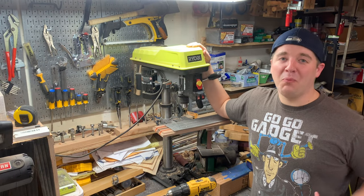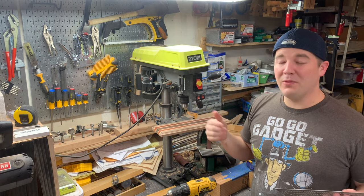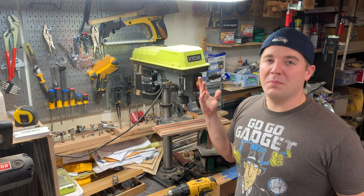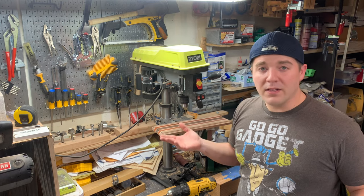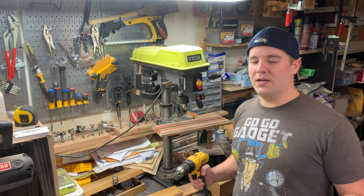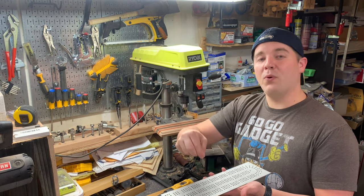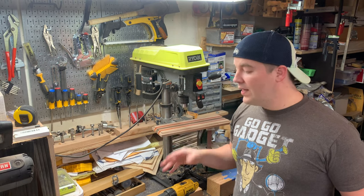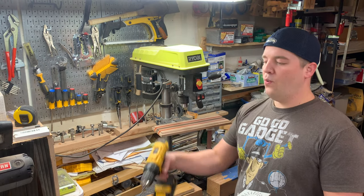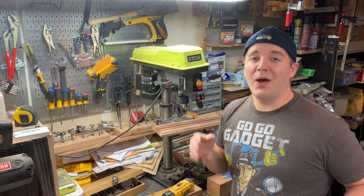The drilling step is the most important part of the cribbage board because you've got to drill some holes. You really want a drill press for this. If you don't have one, you can find them on Craigslist, Facebook Marketplace, or the classifieds. Even Home Depot's cheapest one works. The reason a hand drill is not best here is you have to get that perfect 90 degrees — if you're not at 90 degrees when you're doing the pegs, the whole point of the game is pegging on the board, and if it's all tilty it's just not going to look great. If you're going to use a hand drill, it would be a lot more involved — I would make a thicker bonus template to help guide the 90 degrees. I'd really recommend going for the drill press.